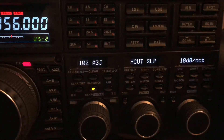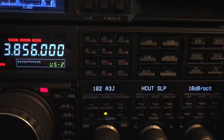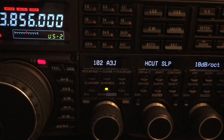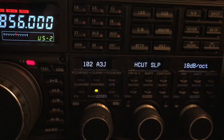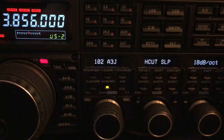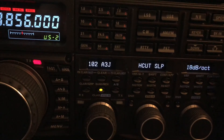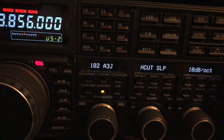Again, even though this is the FTDX 5000, you have the ability to do this high-cut/low-cut and select the steepness — the slope — on most radios, especially most Yaesus today: FTDX 10, FTDX 101, and even previous Yaesu radios. Other brands also offer similar options. By the way, in the music industry this type of audio tapering is called shelving — S-H-E-L-V-I-N-G. It's where you pick a maximum frequency you want to hear and then slope it off from there at however steep you want, in this case 18 dB per octave. You do the same thing for the low frequencies.